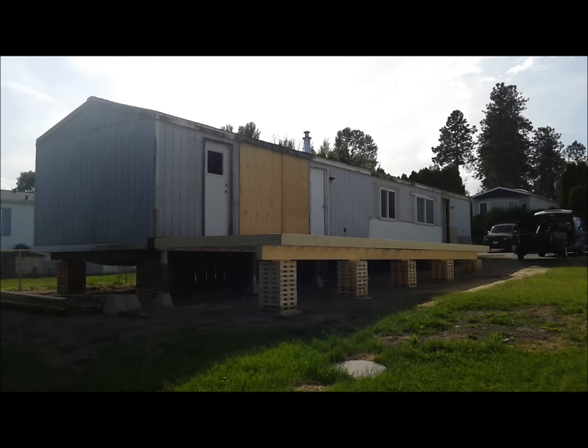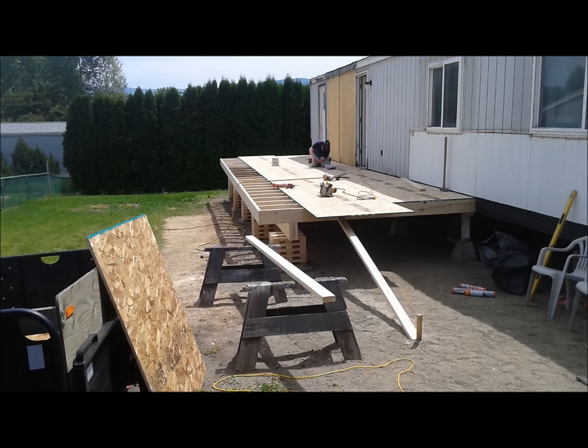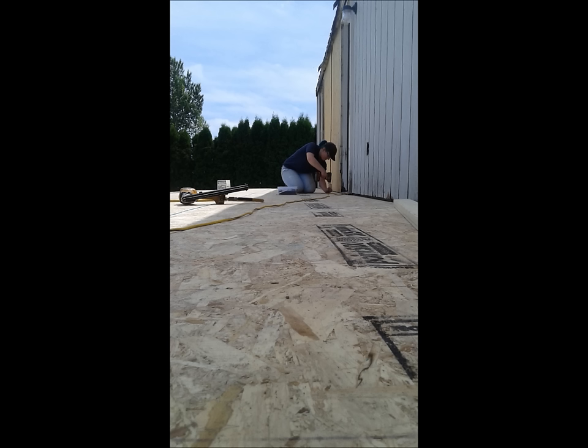The bottom of the crib was treated material sitting on concrete. This view is from the back — that door with the window is where the wall was taken out and the master bedroom was enlarged. Once the floor joists were all set, it was time to get the subfloor down. We used five-eighths tongue-and-groove OSB subfloor, glued and screw-nailed to the joists.